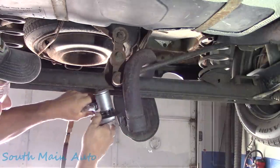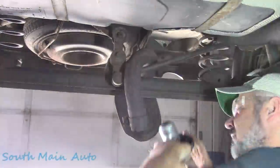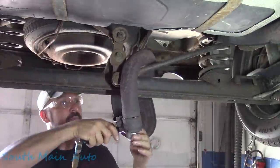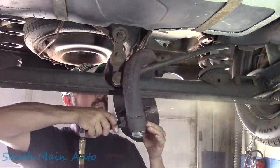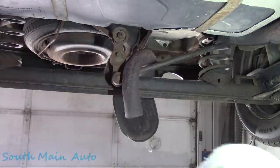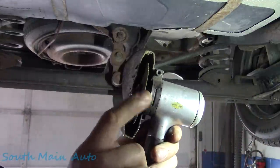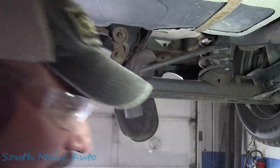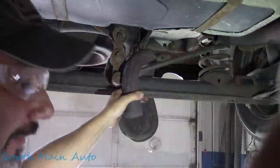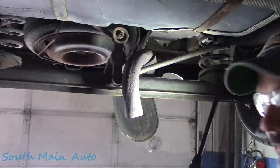That should sound a little weak sauce there on us. That worked pretty good. It's the Astro Pneumatic — she's a four incher. If you buy one of these, it takes a tremendous amount of air to operate it. So if you've just got a little homeowner kit air compressor, it may not function very well. Even with an 80 gallon, 29 CFM — that's about all she wants.